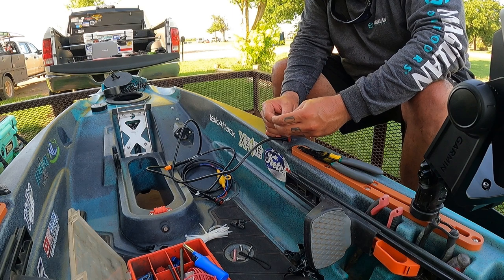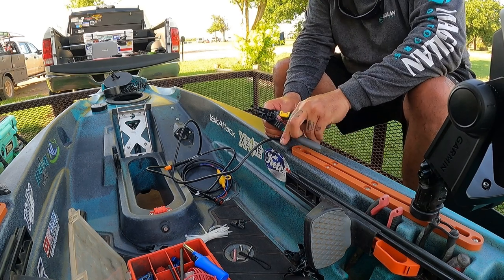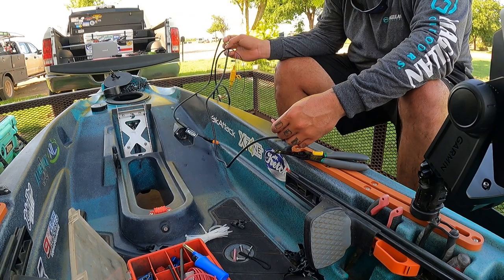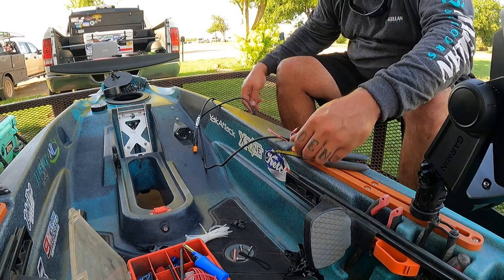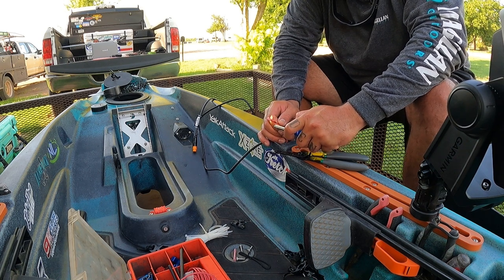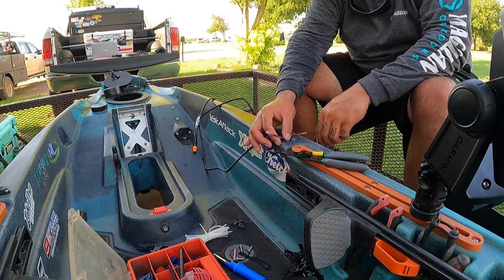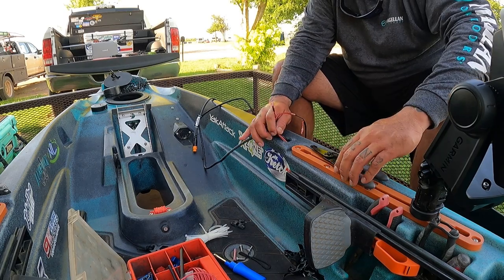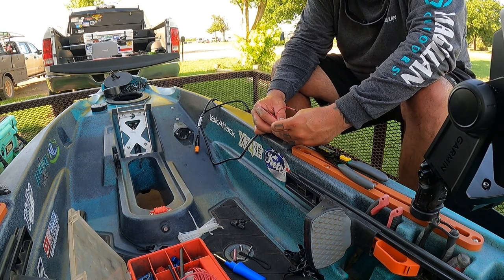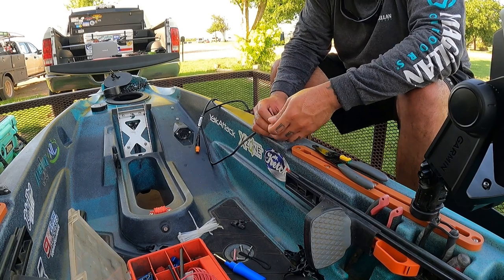Go ahead and take it, put it in, crimp it. Always check to make sure it's tight. What I also can do — because we're going to have to put our fitting back on — to differentiate from positive and negative, I'm going to go ahead and heat shrink this end so I know this end is positive, just like that. Since your transducer wiring is here, keep your wiring from falling back down in your hole — that's if you already have pre-wiring done. Zip tie it so you don't have to worry about it falling back down in there.